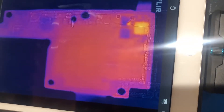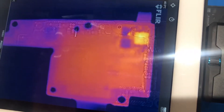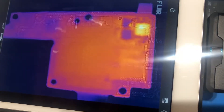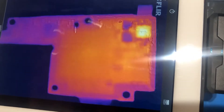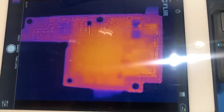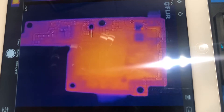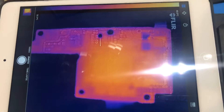You can see it waking up. There's power right there that just turned on for the CPU. I don't see any caps, and I don't see any individual hotspots other than the power supply for PPGPU. Now it's getting really hot, so I'm going to unplug it. I don't see any caps anywhere, nothing that would indicate a cause — but the entire PPGPU rail is shorted good, about 4 to 7 ohms.